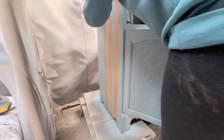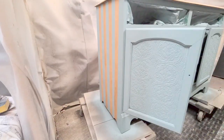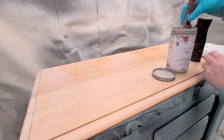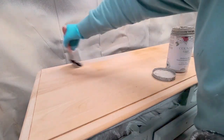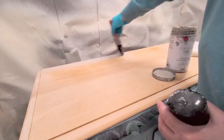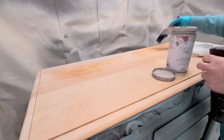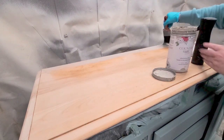It gives character, it gives dimension, it gives texture, and I had fun doing this piece and creating all these elements. For the raw wood top — as I've shown in many of my videos — I like to use beige paint as a wash over the wood so that the paint sits between the wood and the top coat, preventing the tannins from coming through orange when you apply the top coat.